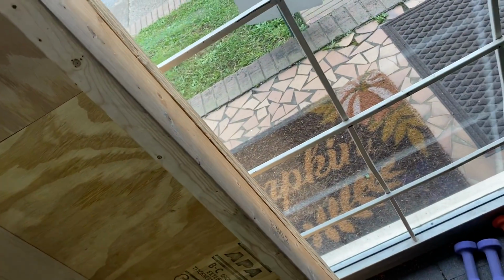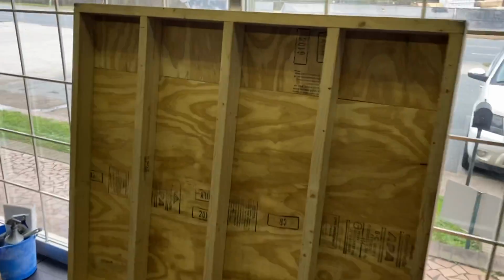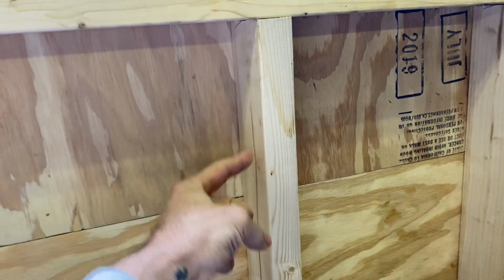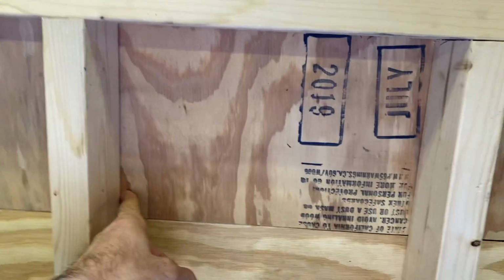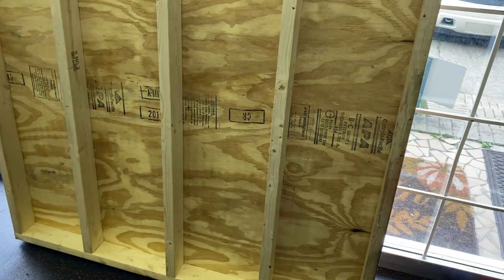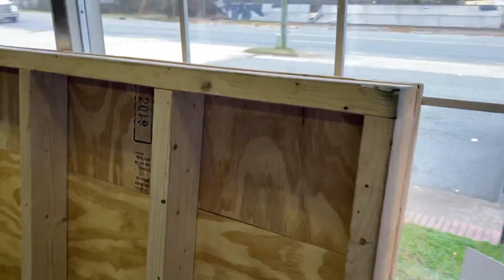Just clean it. All right, so that's the frame underneath, and you can see. I didn't have to put a brace under there because there's one where I just ran right there. So those 2 pieces, that's 2 pieces. So this is 1 piece, that's 2 pieces. And then that is the bottom, 48 inch by 58.5. So these are just 2x4s, and you just space them out equally.